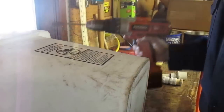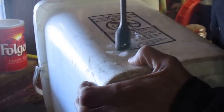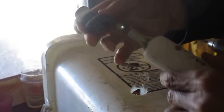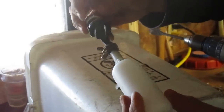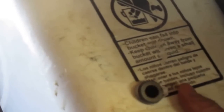So what we're going to build here: I'm going to go ahead and drill a 7/8-inch hole on the back side of the bucket. This valve — you can buy them on eBay. Just type in 'float valve, half-inch pipe thread' and they'll come right up. I think they're like five bucks a piece, so they're pretty cheap. We're going to take this and thread it in — it's going to have a nice tight fit.